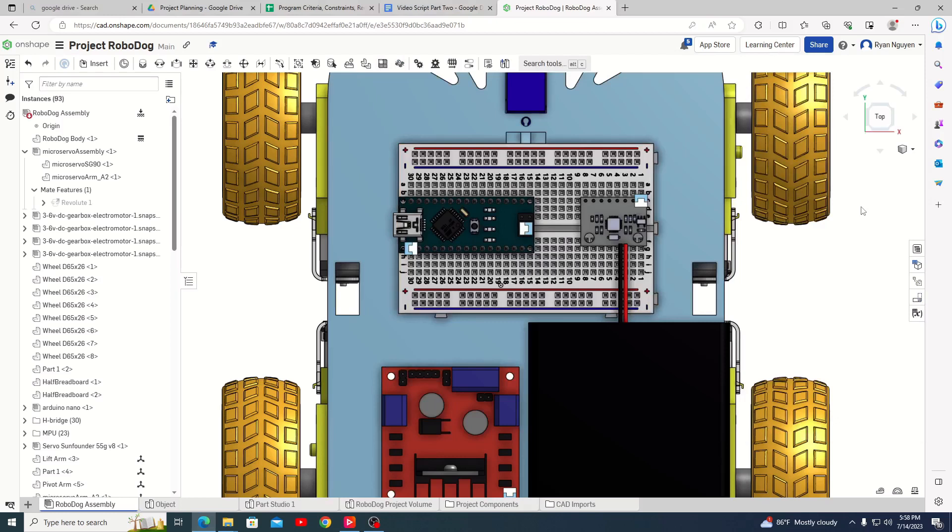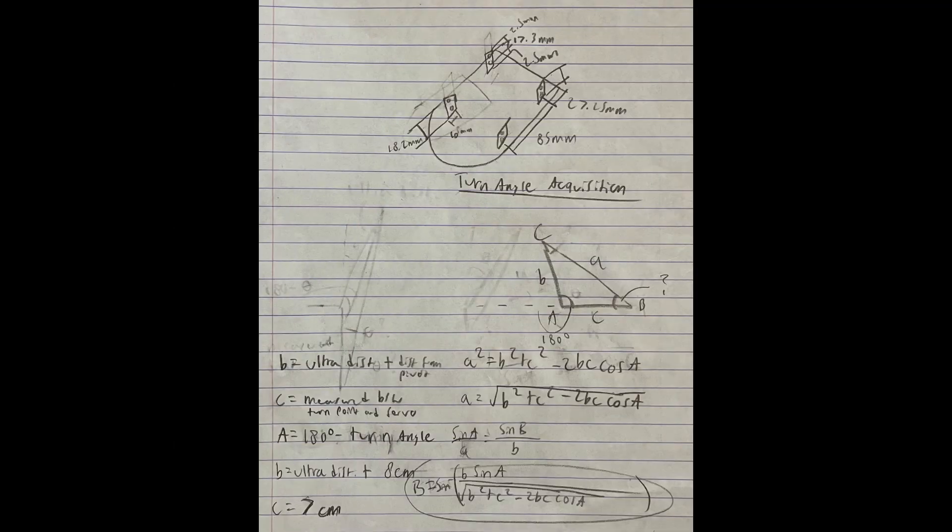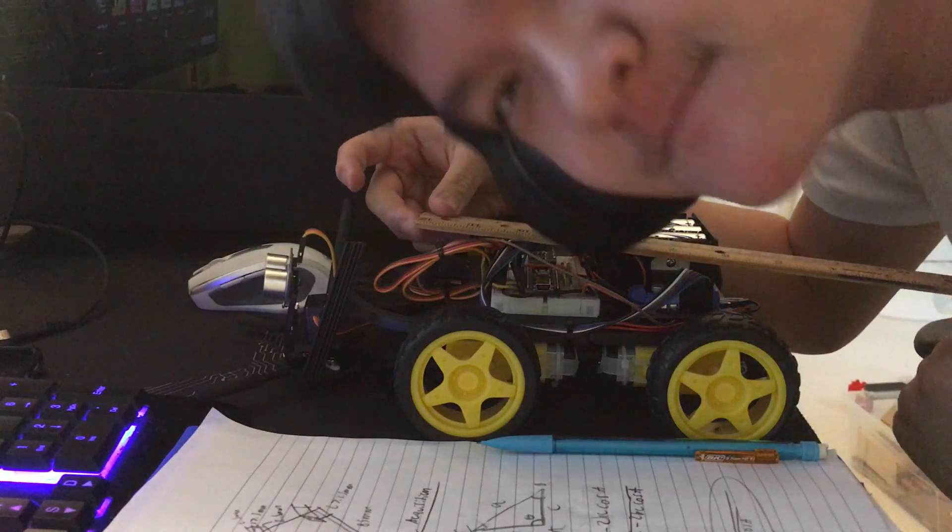Turning in a less precise manner is not desired. We are turning the robot as if the center of the robot is where the center of the servo is, but that is not the case. So I turned to math — specifically trigonometry. Using that, with some measurements, I created this equation. For any math nerds out there, it essentially deals with the problem of perspective: the angle offset to the object from the servo's point of view is different from the robot's point of view. Let's test it out.